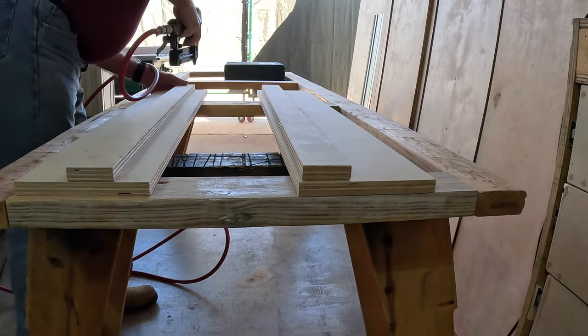We're going to cut these. It's quarter 20 bolts. Okay, quarter 20 T-track bolts. We're going to make this a quarter inch hole. It should be snug in here. It allows it to slide through here. I don't want it to have a lot of slop or play. So we're going to get onto that.